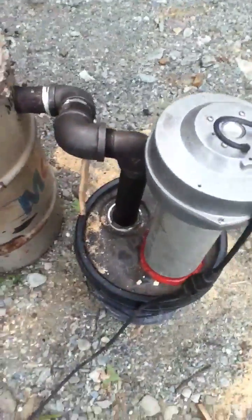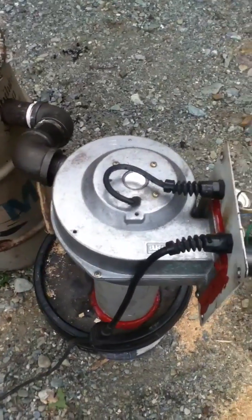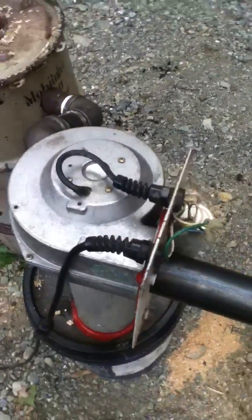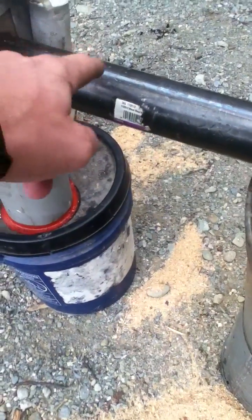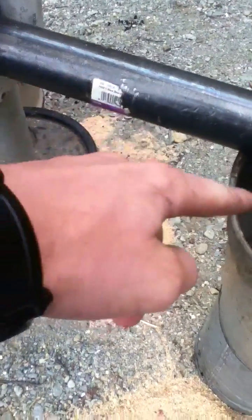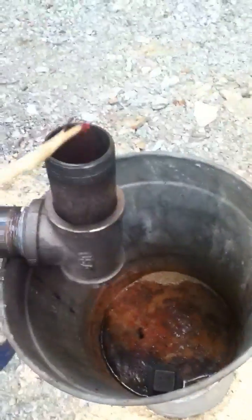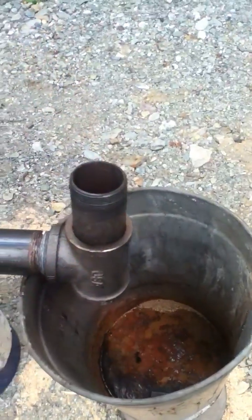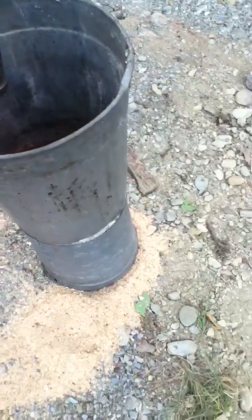The pipe goes into my filter bucket, which is filled with plain sawmill sawdust, and that filters the gas quite a bit. Up here is my blower — it's probably a 20 cubic foot per minute blower. I've adapted it from square to inch-and-a-quarter, then inch-and-a-half pipe, down to a T-fitting, which keeps the flame burning.